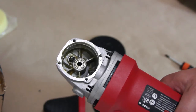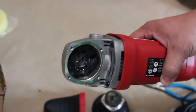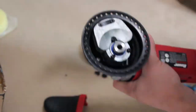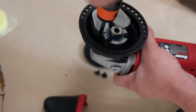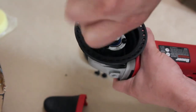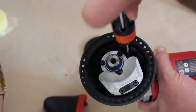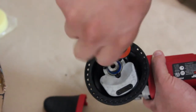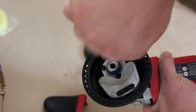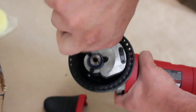At this point you're ready to put in your new grease. I have a grease gun with a high quality multi-purpose grease in it. In the description I will link a comparably good product made by Lucas Oil — their Red and Tacky grease will do the same job and at around five dollars you can't beat the price. You can also go to your local hardware store or farm store and buy it in person. Once you put the grease back in the main case and around the gear on the underside of the plate, you are ready to begin the reassembly process.